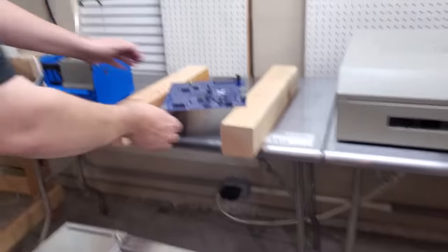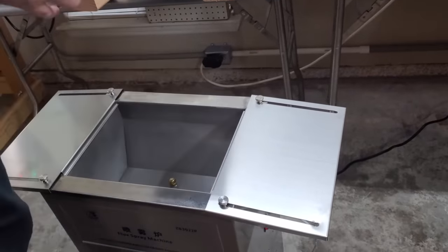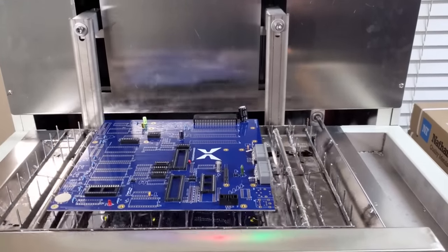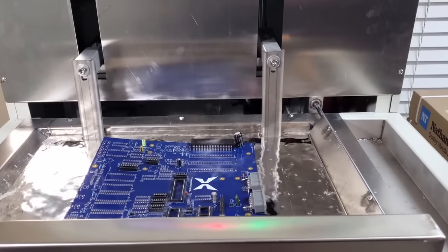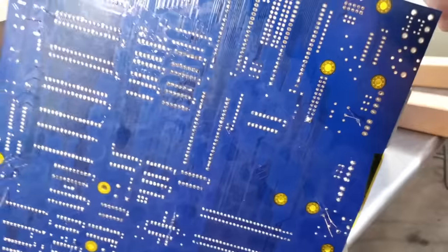time to test it out. So this is just an older Rev PCB Kevin and I had laying around, we thought we'd use it for testing. So step one is to spray the bottom with flux, and then we'll set it on the bed of nails here. And here goes. You may notice the board warping like crazy. Well, you know, I mean, we didn't expect that. We're new to this process. Although it did kind of work, a good 90% of the joints did get soldered.